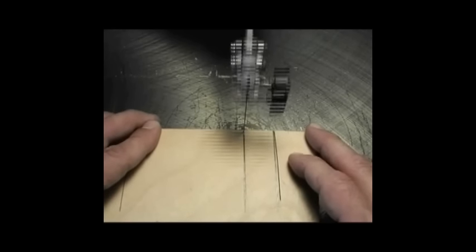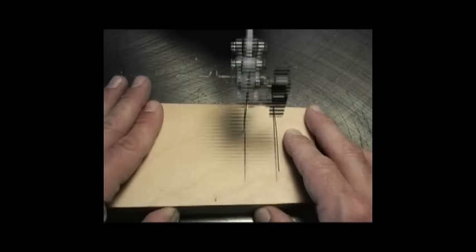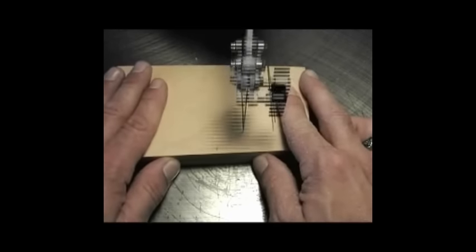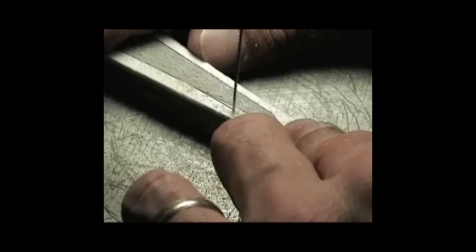If your blade does wander off while you're on the line, don't try to immediately correct back to the line. You'll wind up with a big hump that can be a problem. Instead, gently bring it back to the line, or at least parallel it, and then bring it back by increasing your deflection slightly and picking up the line with a bit more deflection than you previously used. You can also go back to a section of the line that was straight, place the blade back up against the line, and slowly increase the deflection as you move forward, bringing the blade into the line. Also, if you know you're going to go offline, it's of course better to go off into the waste area than into the finished side of the line.